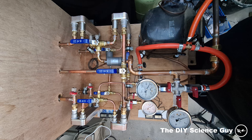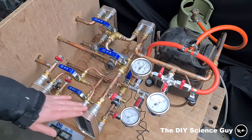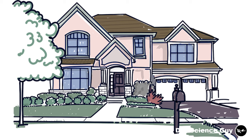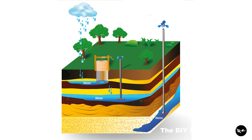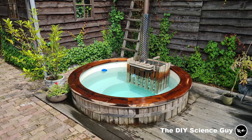This heat pump does not invert its refrigerant cycle; instead I can change where each individual heat exchanger is hooked up. During summer it will supply cold water to a heat exchanger in my house, and the heat removed from my house will be pumped into my hot tub, a boiler to heat shower water, or as a last resort dumped into the ground via groundwater. In winter it can extract heat out of groundwater and supply that heat to my central heating system. Also, when I heat up my hot tub with wood I could supply that stored heat to the heat pump and use it to heat my house — efficient right?